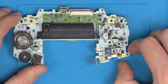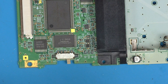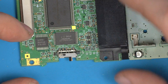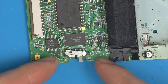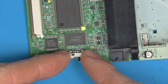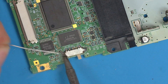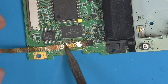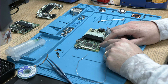That's the perfect replacement switch for the GBA. For the GBC it's exactly the same thing — remove the old switch, place the new switch in position. Once in position, the pads solder over: pin 3 goes to the left, pin C goes to the middle, pin 2 goes nowhere (you don't mind if it's bridged), and pin 1 goes to pin 1. Whip off the old power switch just like we did before, and grab the new power switch.